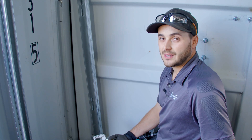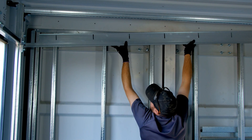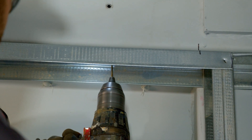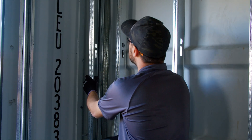Always measure from the end that has the electrical grommet hole and work your way back, cutting off the excess so all the holes are neatly lined up. A lot of people are nervous about working with steel studs because they're used to wood, but steel studs are so light you can slowly dry-fit everything before securing. Once you've done it once, you have the experience — I encourage everyone to give it a try.